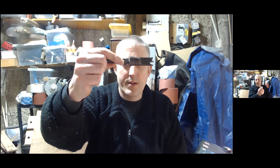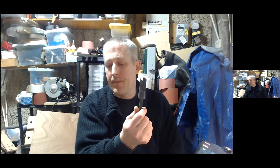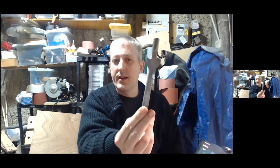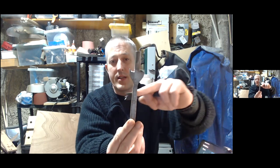I'll finish off with my favorite little bit from my collection at the moment: the cock plug bit. This was used by cellarmen to drill open a barrel before they put a tap in — it's basically a center bit, but as it breaks through, it plugs its own hole so you have time to go get your tap and avoid wastage. There are also lots of weird and wonderful variants, like the counter bore bit, which is designed to follow an existing small hole to make another hole that you put a plug in to conceal nails, screws, or various fasteners — used a lot in decking for boats. There's literally no end to the weird and wonderful bits out there. I think we've been going for about 50 minutes — I better stop and see if anyone wants to ask any questions. Thank you all very much.